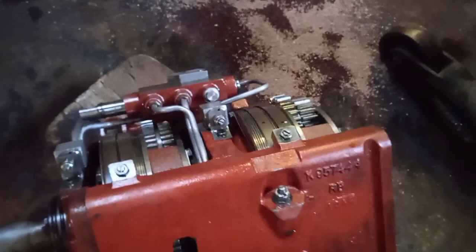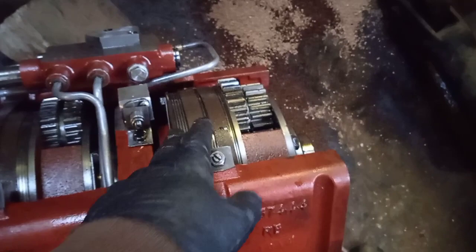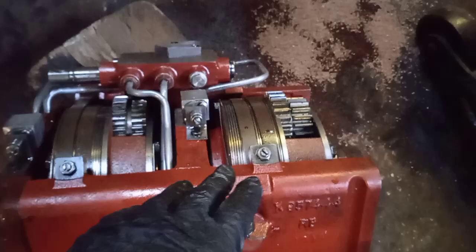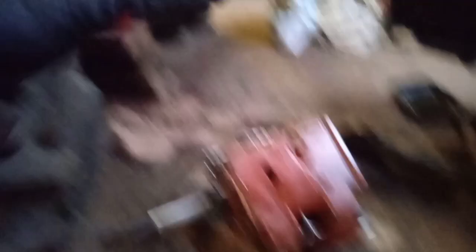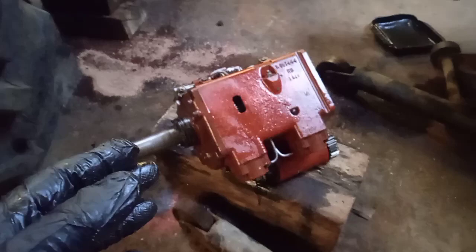You've got one sequence valve for each brake band. What we're interested in is this back clutch and what the hell's going on with it, so I'll take that to bits and have a look. If I can't work out what's happening, I can take it to Barclay Williams who've got a test bed where you can just run that unit without having it attached to a tractor and set the whole thing up. Even if I do find out what's going on, I might take it there anyway to get it set up — it'd be a lot easier, and a nice little ride out to Evesham.